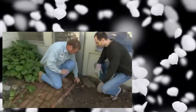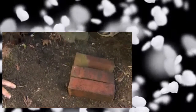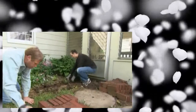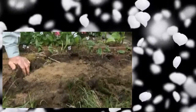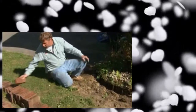It's all going to start with removing the bricks. These bricks are going to come up pretty easily - you can see there's nothing behind them but topsoil, so they're not held in place at all. Every brick you take off, keep it back about two feet, nice and tight and straight so we can get at them easier when we go to put them back in. Sand never packs up hard - I can just take my finger and scratch all the way down through it.